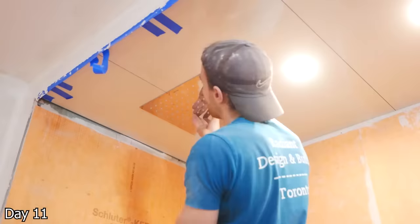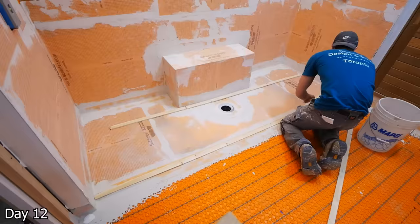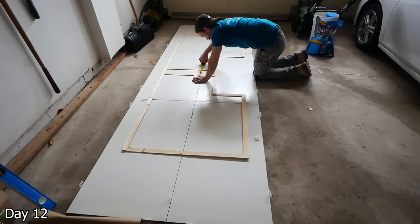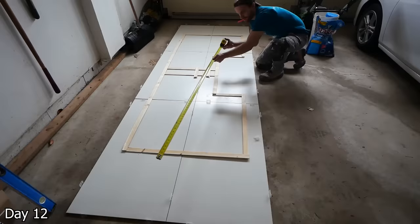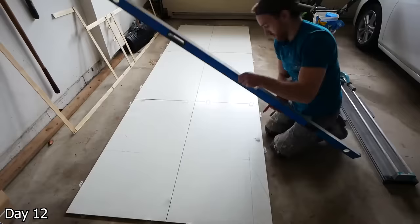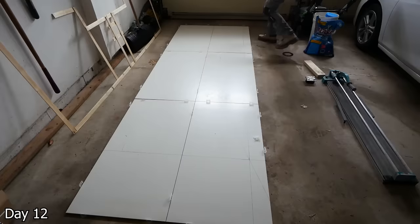Now the shower floor. I just take a two-by-four, rip it down into about a quarter-inch little strips, and then get them in the shape of the shower pan. I use a hot glue gun to adhere them together, marking out the drain grate and all of the perimeter. Then I laid out the tiles on a somewhat flat surface, transferring over the template, getting the drain centered and then marking out — really I want to just get the corners here and the drain grate. That way I can take my straight edge, marking corner to corner, and just getting those lines established so that I can make all the necessary cuts.